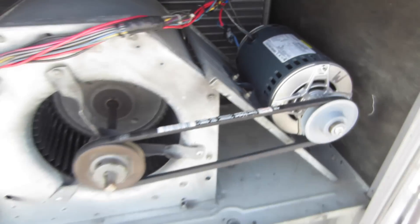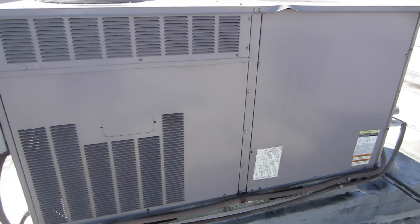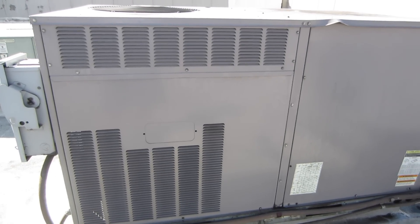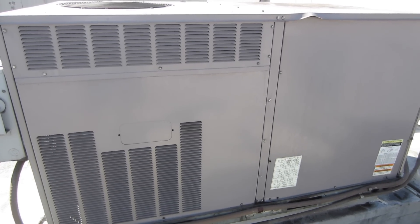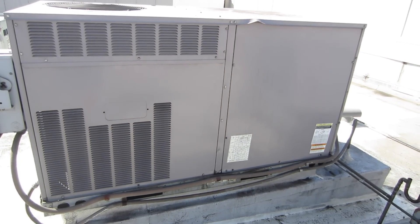See what range we got here. The unit's all back up running. My total amps was service factor amps, so I set it at 5.6. That's it — the indoor blower motor installation.